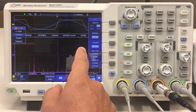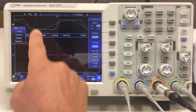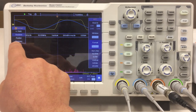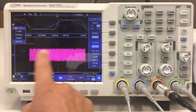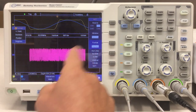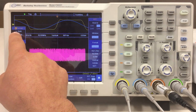For format, you can choose either decibels or RMS voltage. Looking at the FFT of the sine wave, you see a very sharp peak. You also have radians or degrees if you want to see the phase shift. On a single sine wave you won't see phase shifts between different frequency components, so let's play a bit with the rectangular wave. Let's go back to decibels.